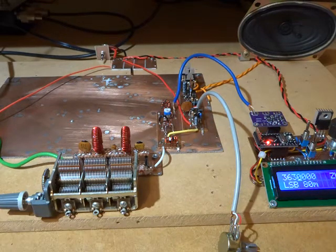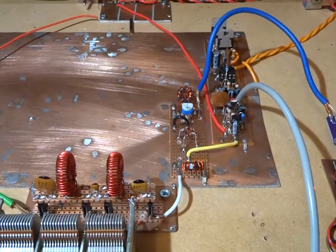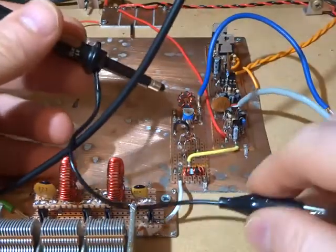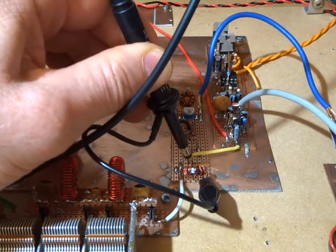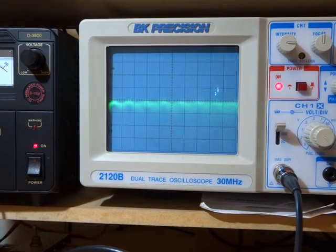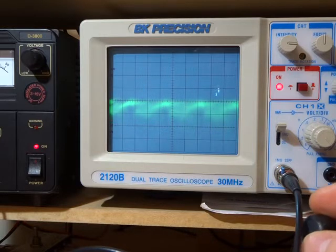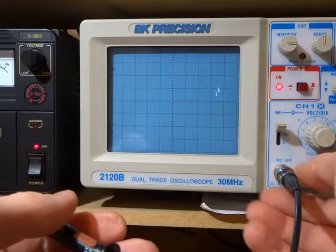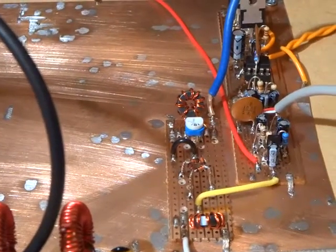Now, in terms of that trim pot on the mixer, I'll just turn the oscilloscope on and scope the output of that mixer — the output is the yellow wire there. We can crank that right up and go up to the scope. I'll just tune that trim pot subtly and look for the null. I'm right up on the highest possible amplification on the X value I can get, just tweaking it there and looking for that null, which is around there. And that's all I do to null out that trim pot — it looks like it's pretty well centered, so that's pretty good.